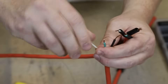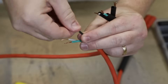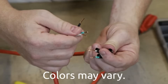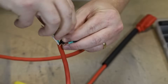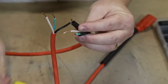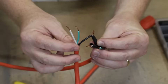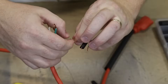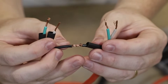Now we can twist the wire ends so they're a little easier to work with, twisting them into a quick spiral against themselves. Make sure you're connecting black to black, green to green, and white to white. Rather than twisting them together straight on — which causes them to stick up from the side of the wire — instead wrap them around each other so the wrapping allows the wiring to lay flat. As soon as I've got the first one wrapped like this, I'll go ahead and solder it.